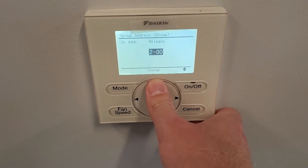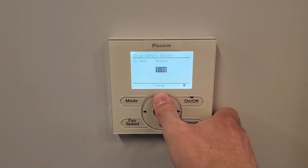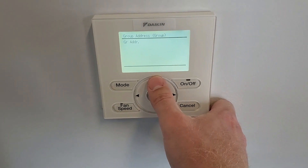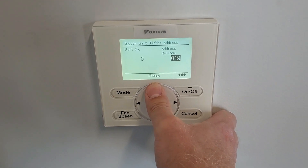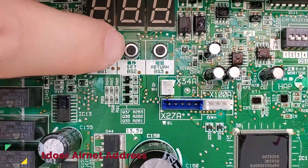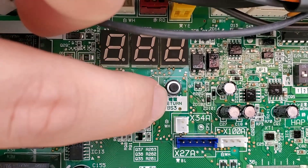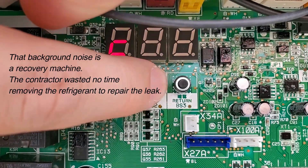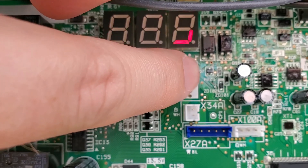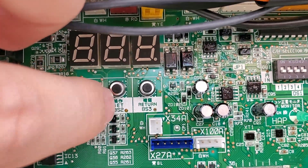It's up to you whether you do the field settings now or after you run the system test. Because the outdoor unit had a leak this morning, we were unable to operate the equipment, so we focused on getting all the controls work completed first. You'll want to get all of your thermostats programmed and addressed all at once so you're not going back and forth wasting time later. Now we're going to AirNet the outdoor system — setting 2.13 — and address this outdoor unit as one. Return, back to 2.00, and escape. AirNet is now addressed.